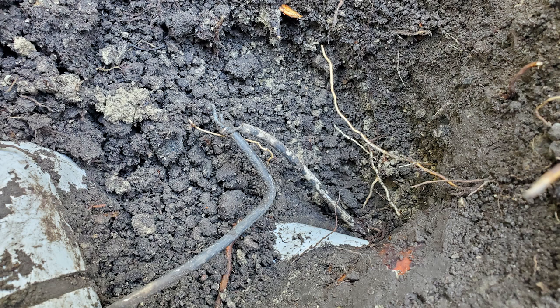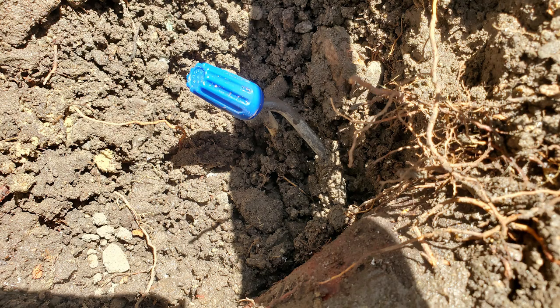While I was digging, I found this hokey wire repair wrapped in plastic. This is the common wire. I dug it out more to make it easier to repair. I cut the bare wire and created a fresh connection with a watertight wire connector.